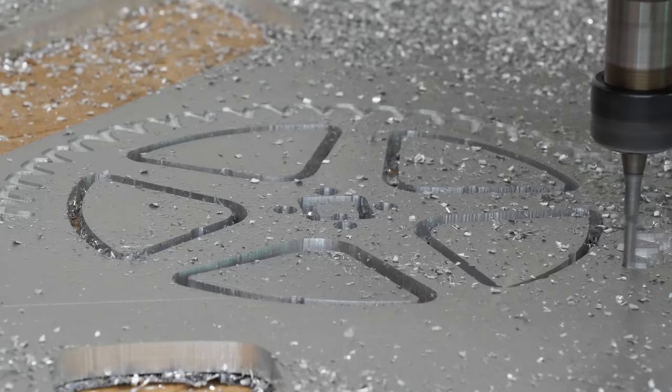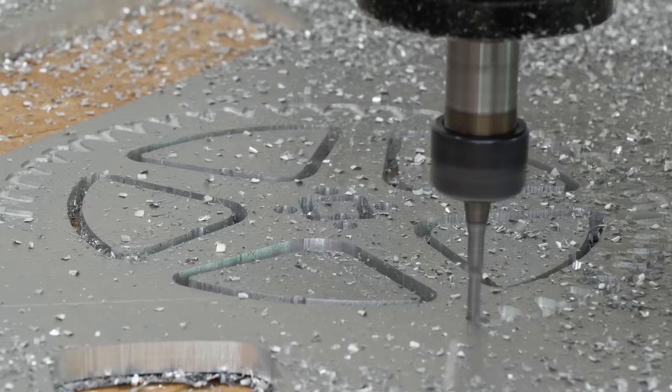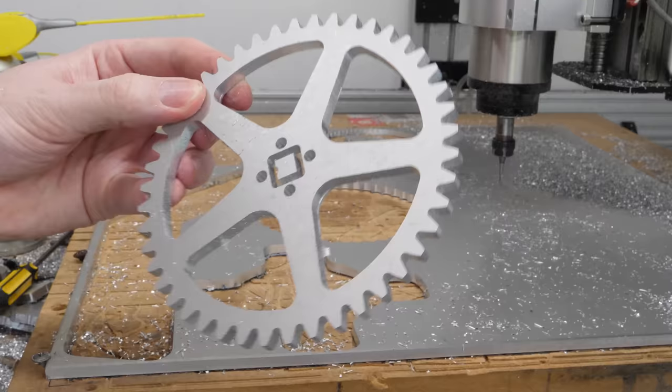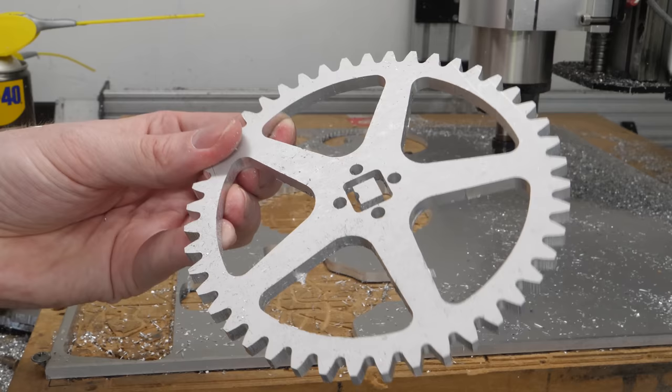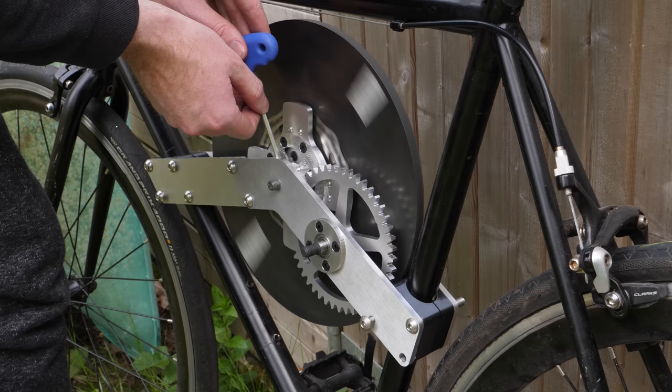At regular cycling speeds, bike wheels don't spin much faster than about 300 RPM, but I need this flywheel to spin around 2000 RPM to store the energy required to get me going again. So there needs to be a large gear ratio between the bike wheel and the flywheel. This means the flywheel will spin in the opposite direction to the bike wheels, but I'm hoping that won't be an issue. So the clutch design kinda works, but it also sticks a lot.